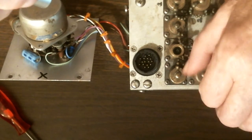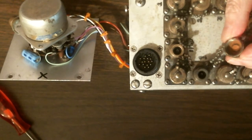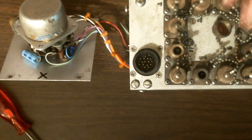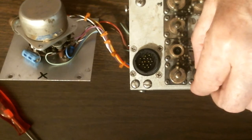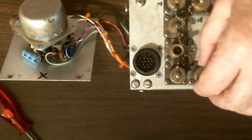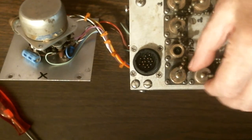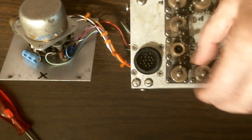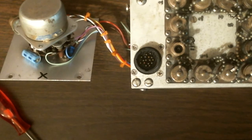I use these protective caps because up here in Connecticut, and I guess other places too, there are little bugs that fill up small holes — especially up high — with mud, and they put an egg in it. So when you go back to hook up an antenna on a connector you left unprotected, you might find hard mud and break the connector trying to remove it. These caps are very cheap and you can find them at flea markets.